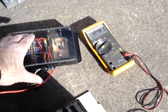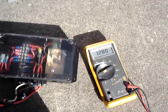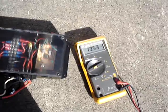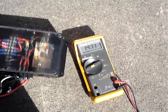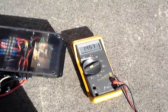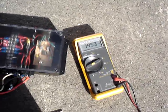If I'm not shading the solar panel, you can see the voltage coming up as the controller is sending voltage to the battery. But the battery is pretty much fully charged, so we're going to very quickly hit the upper set point and the charge controller will switch back to dumping the load rather than sending it to the battery.